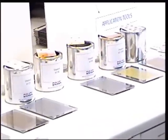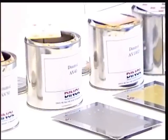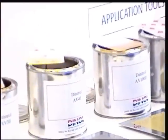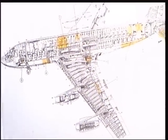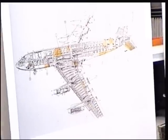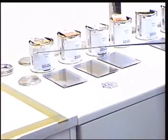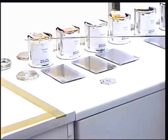Originally we have been using AV8 and AV100D on the lower lobe and this part of the aircraft down there. As you can see on this chart, AV8 plus AV100. This has been replaced now with AV30. You can still use those — this is recommended for very old aircraft. The previous materials, or LPS, they have about 20. It's quite a big difference.